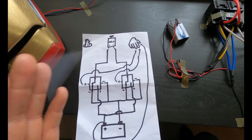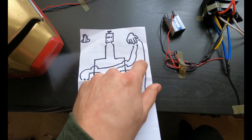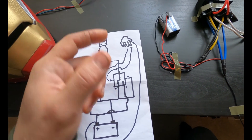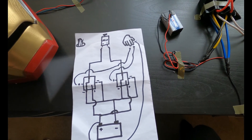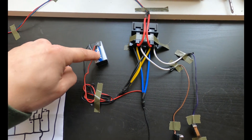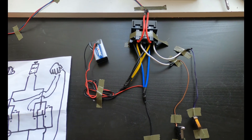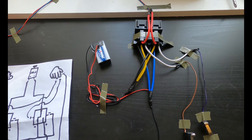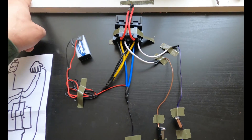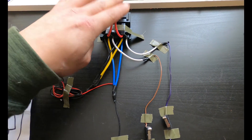Then I let my finger go, switch over to the other one — it pulses 12 volts to that relay, switching it over to 12 volts, while the first one is now at ground. So the other side of the motor gets 12 volts. You just switch back and forth and it spins the motor forward and back. All I'm doing is closing a circuit. Instead of fingers you could use a momentary push button mounted on the side of the helmet — really anything you want. You can use a 5-volt, 9-volt, or 12-volt battery depending on your servo.